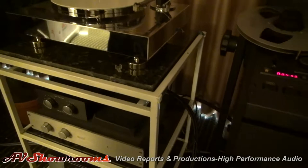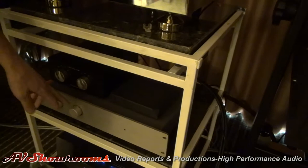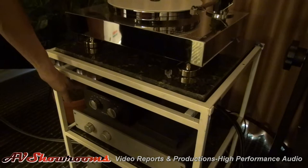I know the Phono Stage very well — I have two of them. That's a wonderful Phono Stage. It lets you have three inputs, and there's about 15 steps of input impedance. Our step-up device has three choices of step-up ratios, and for each of those, eight input impedance changes.